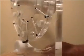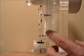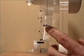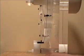I've grooved the outer edge of the periphery of the wheel, as you can see right here, and I've put this piece of wire, it's a steel wire. I experimented with soft iron wire, pure nickel wire, and some other wires. The attraction was too strong to some of those wires. I finally settled on this steel wire.